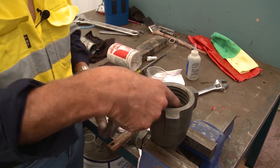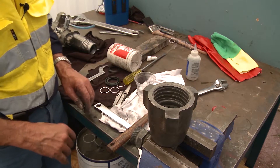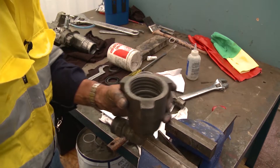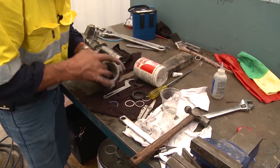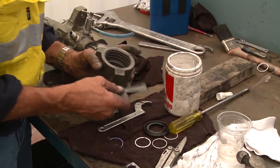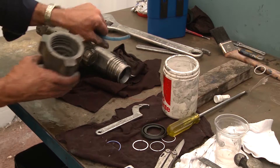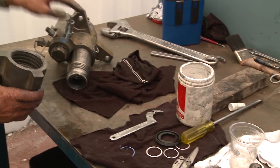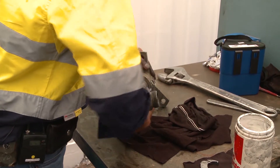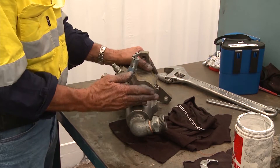We put a new ball and seat in. To check it's okay, put some oil in there and ensure nothing's coming out the bottom — there isn't, so the ball is seating correctly. That is a good repair, good to go back on the machine. Run the oil around the top to assist with lubrication. Squeeze the remaining anti-seize around the thread. Put the foot valve back on to protect the ring land — you don't have to tighten it, just protect it — so all the shims, ball cage, ball, seat, and o-rings are safely inside.